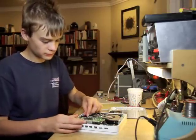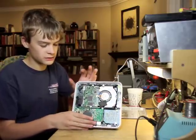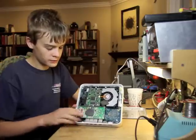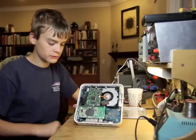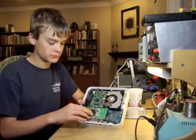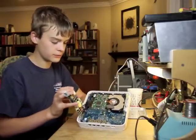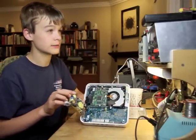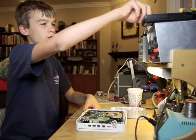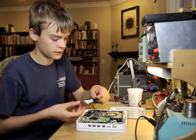So I suspected the problem was — because when I plugged this in just about nothing happened — this is what's inside. I suspected the hard drive had failed, but actually the power supply had failed. So I pulled off all this packaging and it's a pretty basic little power supply. I have all the specs on this little sticker that went on the top, because this was fully enclosed in plastic and I pulled it out.